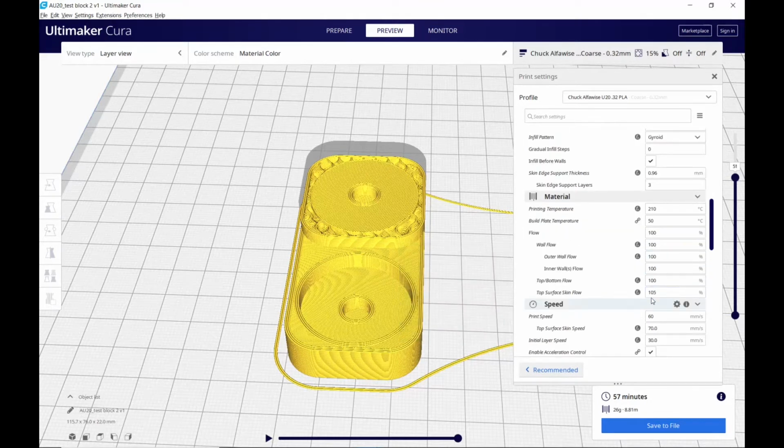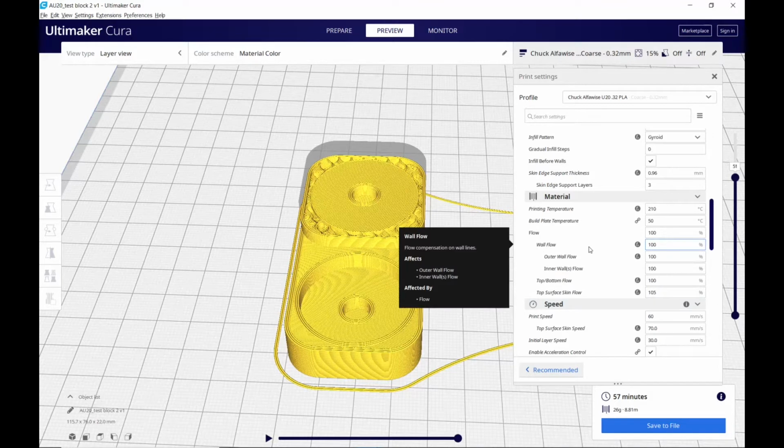So top surface skin layers are something I have added 3 of, and I couldn't tell any difference at all. And I kind of figured, well, maybe they're not for this. I didn't really know, but the more I dug, the more I found out that if you don't change the parameter for the top surface skin, you're basically going to get the same top surface skin as you got for the bottom surface skins, for the first few layers of surfaces, in other words.